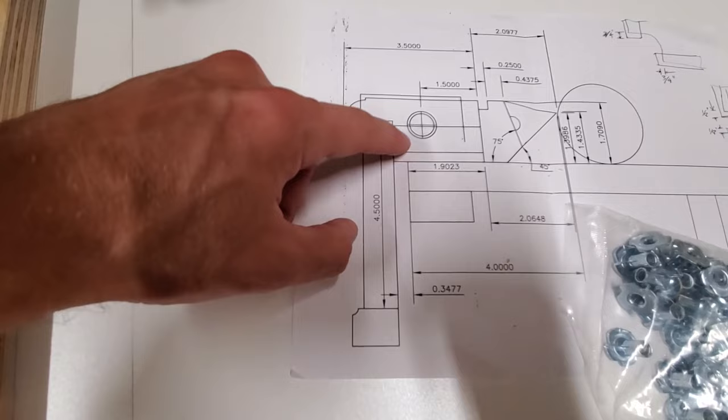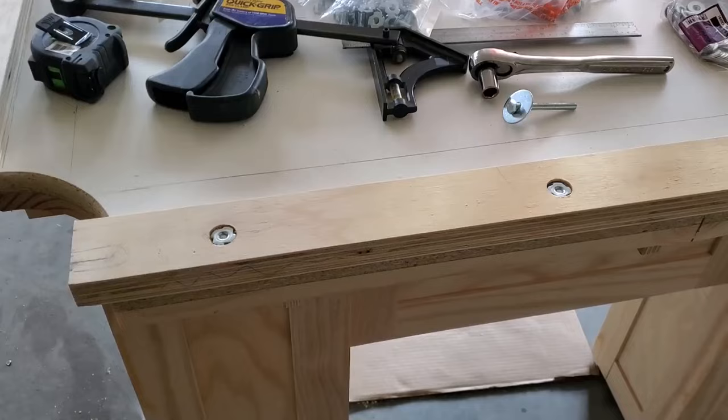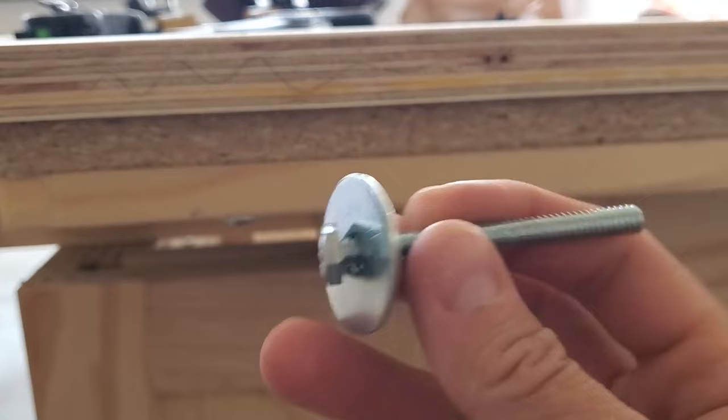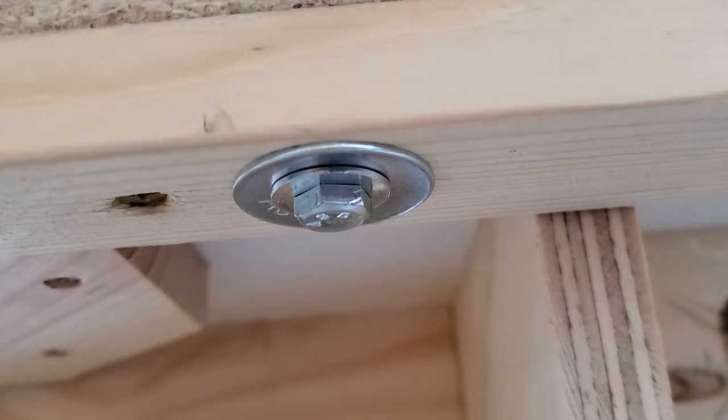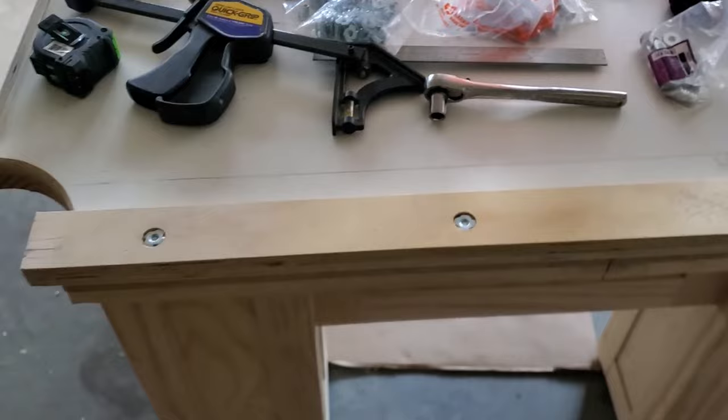It's going to get held on with bolts coming up from the bottom side. I countersunk these holes so there will be T-nuts in there. This is just the bottom half of the sub-rail — a quarter-inch and three-quarter-inch piece of plywood. The top of the T-nut will be right on that line, the bolt comes through to the bottom, and the top of the rail will hide the T-nuts so they'll be permanently sealed in. That seemed to work pretty well — just a two-and-a-half-inch bolt with a fender washer and a regular washer to spread out the load.